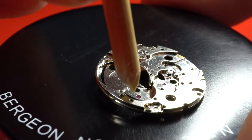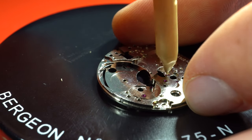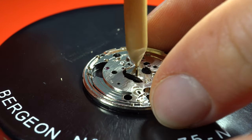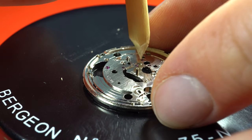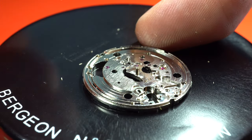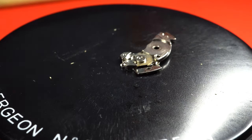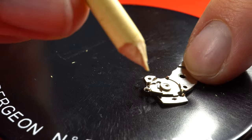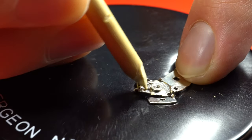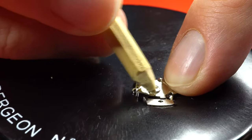Now I'm going to take a little bit of pegwood and clean what I can before putting everything into the watch cleaning machine — cleaning all the pivot points. Those are synthetic rubies that guide as pivot points for the wheel pinions. It's not bad to clean them a little before putting everything to the watch cleaning machine, just to get all kinds of dirt and debris off. Also here the barrel bridge, which has some dried up oil — you can see some gunk. But all in all it's not so bad.